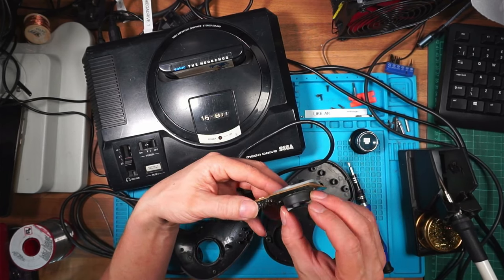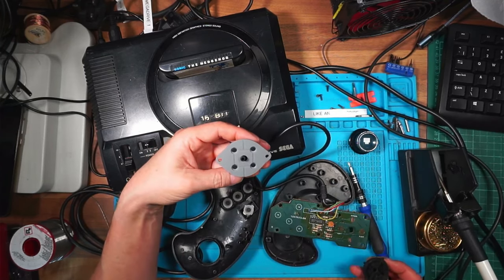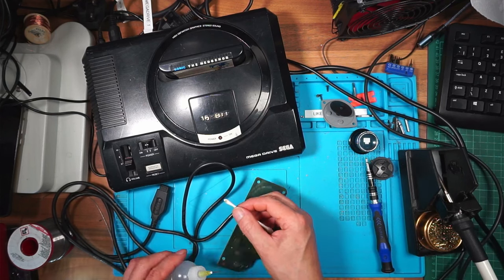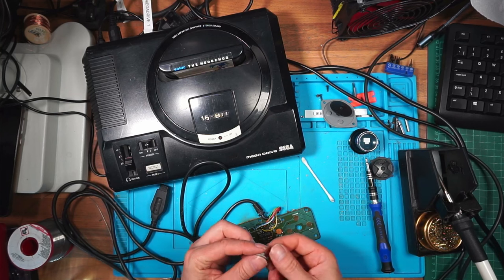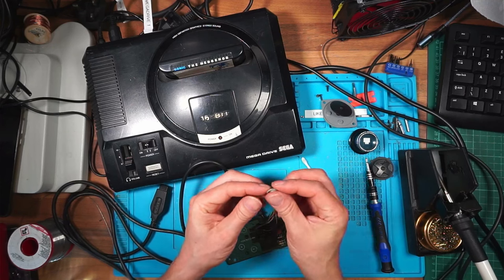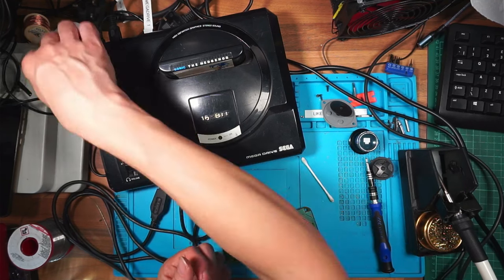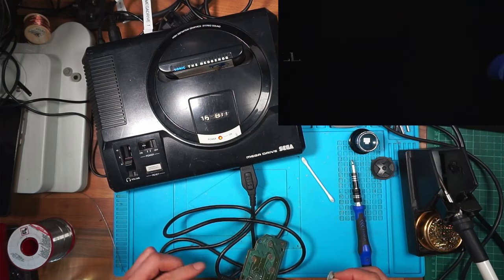This is strange - look at that: you press down on that one and it presses the other one up. The chances of repairing two of them are getting slim. But these are dirty so I might have a chance - the wires look intact. Looking at the pads: one is torn - that could be why it's not working. Two more torn pads. So I've got two torn pads - I wonder if that corresponds to the fault.